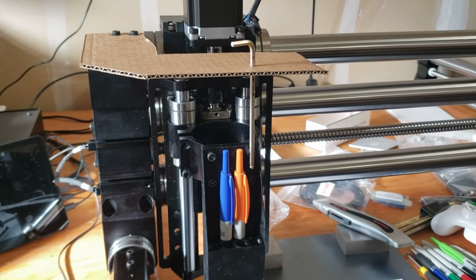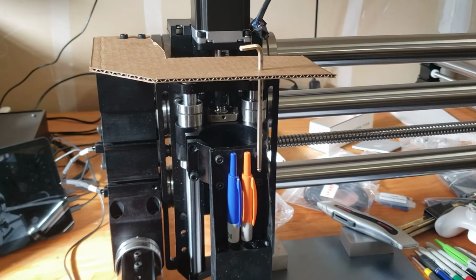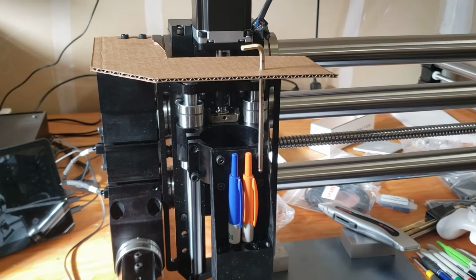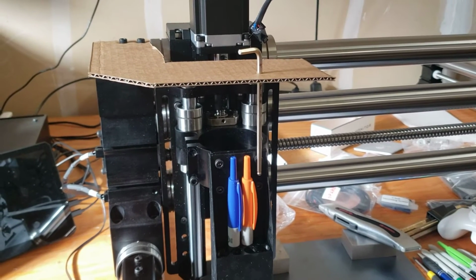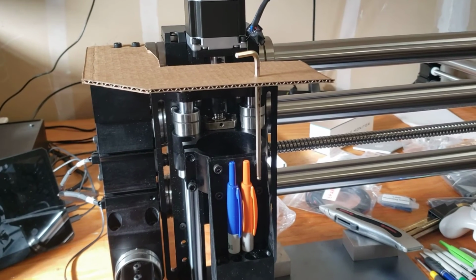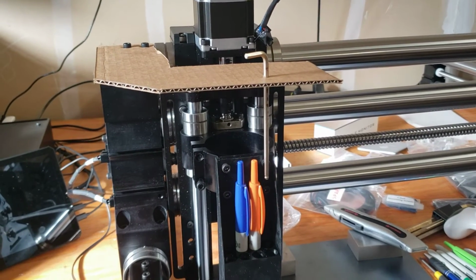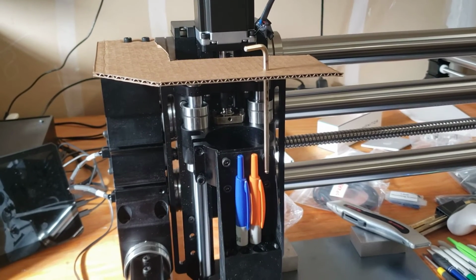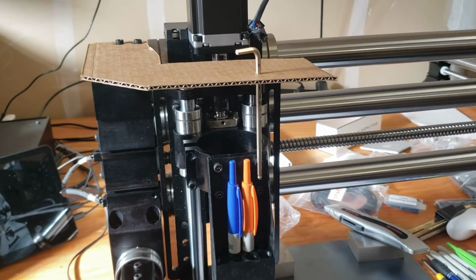And just to prove the concept works, I really dig it. And I also kind of like that I only have to track the Y position to get back, as opposed to having to track both X and Y. And this would also cut down on X movement during pen changes. Would get rid of X movement during pen changes entirely.